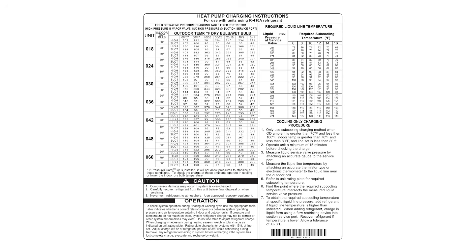This is a little bit of an older chart - I haven't looked at one of these charts for a newer piece of equipment in a long time, so I don't know that they look exactly like this. But there's going to be some sort of heat mode charging guideline you'll be able to find. Generally speaking, if it's lower than 65 degrees outside, that's when charging in heat mode is going to make more sense. Now I want to pause quickly because there's a difference between checking the charge and charging.